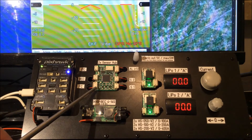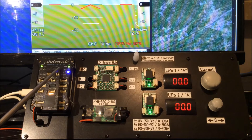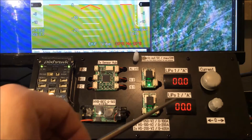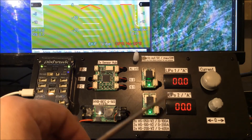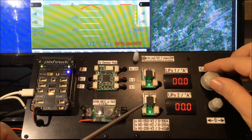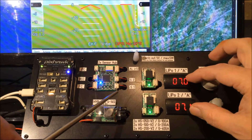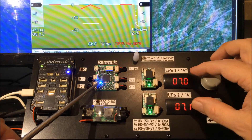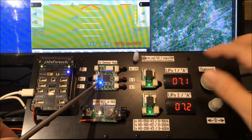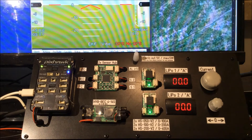In fact we will not see this over Mission Planner. Let's see — we switch on, self-tests are done, and we got a blinking blue light, which means standby. Our flight controller here is a clone, so called, and it is finished booting. The current is zero at this moment. So the first demonstration is a normal setup without any problems. We increase the current, and in that moment we go over 2 amps from each battery — the sensor has to recognize it. The blinking light will stop, go solid, and recognize that right now we are drawing current. We go back to zero — now both batteries are equal. Let's connect this into Mission Planner.